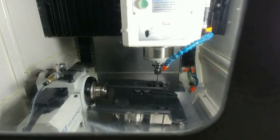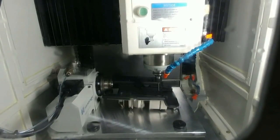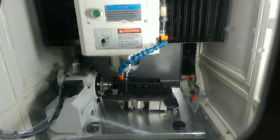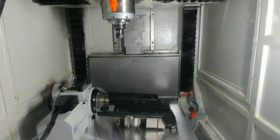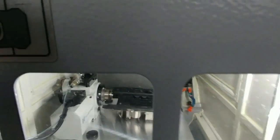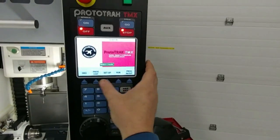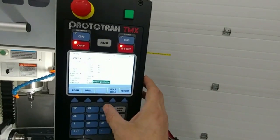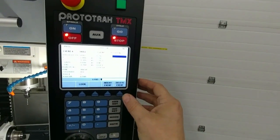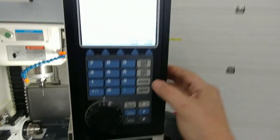I don't have it actually drilling — I have it placed above the holes. You can see it's doing variable pecks at each hole instance. At the end of the part it rises to the top again and goes off. What you could do — if you wanted to, I didn't do it — is you can add in a program event at the end such as a position event, so you could position it at the last thing as it comes to the front so you can just pull it right off. It's easy to do.